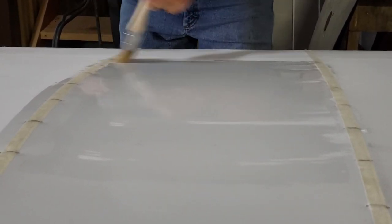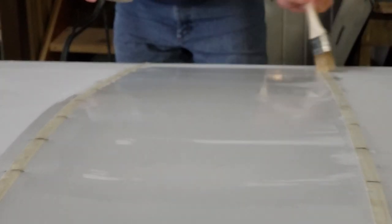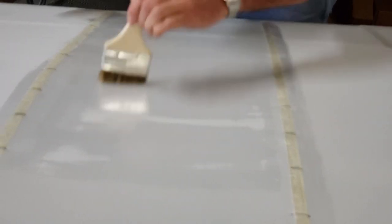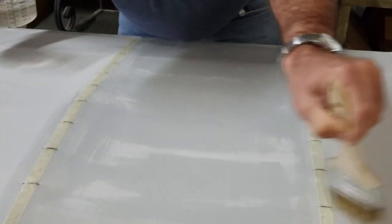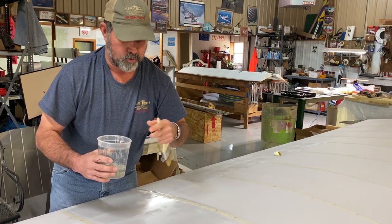According to how hot it is outside — we're pretty cool in here today — I'm going to work all the way across here, keeping it moving fast. This isn't like the normal glue, so you're not really leaving a lot of ridges; it's mostly thinner. But once I did that, I get my glue out of the hand and then looking at the light, I'll go the other way. I may change the direction of all those little ridges, and once it dries, I'm not feeling all these ridges of glue because it's really thinned down.